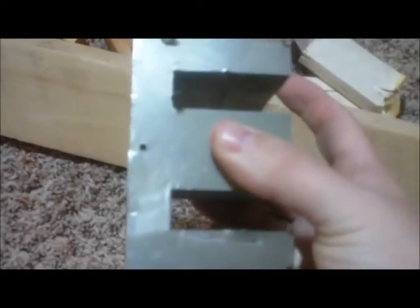There's an E. Basically I'm going to take the E's off of that one, make an E like this, then put the E on top and epoxy this back together, and I'm going to rewind this. But first I'm getting everything apart — I had to break all these pieces. There's basically the E and the I; they're just epoxied together. Some are bolted, but these are all epoxied pretty much. So busted all these out — this one's ready to go.